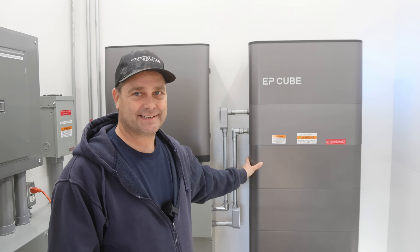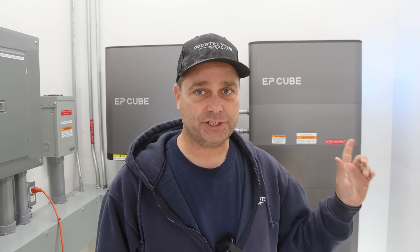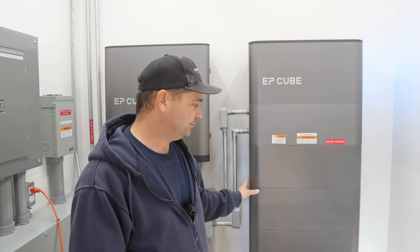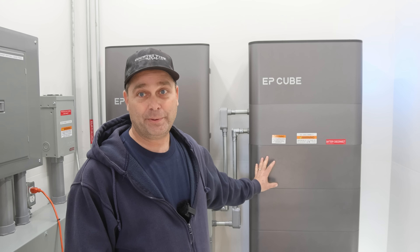I know what you're thinking — will the batteries even last 10.6 years? The answer is yes. They are designed to last that long. The batteries have a 10-year warranty and are rated for 6,000 cycles. A cycle is one discharge — if you discharge once a day, that's 6,000 days, or 16.4 years. At 6,000 cycles they're rated at 80% of original capacity, so it's not that they've failed — they just store 80% of what they used to. If we decide to replace them at 15 years, that's still four and a half years of use after the system has paid for itself.